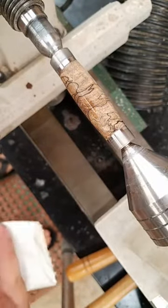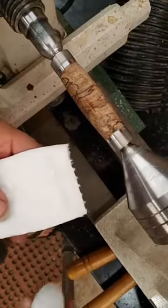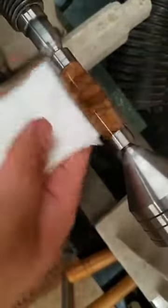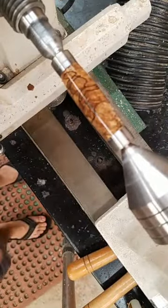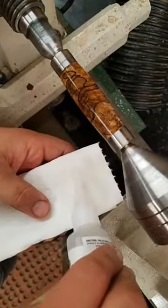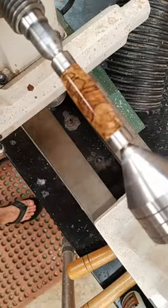Do you know a good wood to start with? John, I think one of the best ones to start with is cedar. It's reasonably cheap. It turns smooth. It gives you a good idea. It's a little bit rough on your tools. It'll dull them kind of quickly. But it's nice to turn, and it's cheap. That's the biggest thing. Do not pick up a piece of 2x4 and try to turn it. It sucks. Get some maple or cedar or some other kind of wood. Try to get a soft maple if you can. Maple and cedar are the easiest to get, cheapest, and simplest to work with.